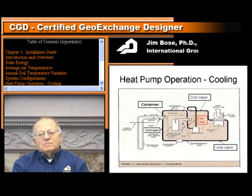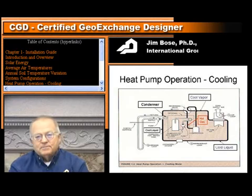Same heat pump, same ground heat exchanger coil. He told me that he had replaced a couple of contactors that are in the system to start the electric cycle going. So that's a lot of hours, 50,000 hours, with no maintenance other than changing filters and replacing those two contactors. So whenever you're looking at comparable systems, or you're trying to sell your system over something else, you want to take into account these things are good for a long time.